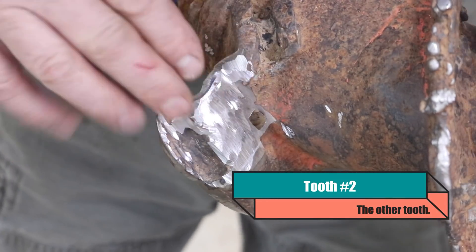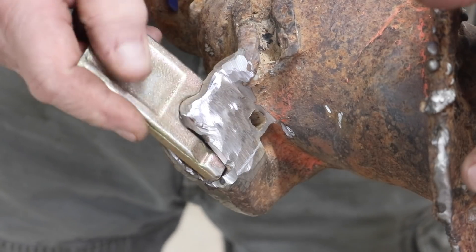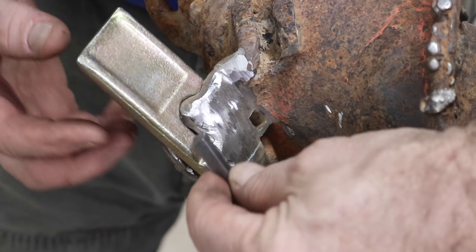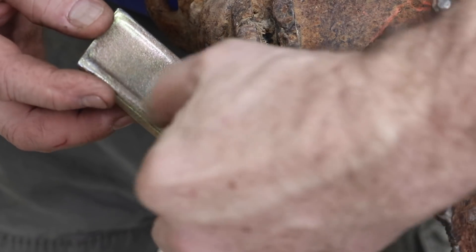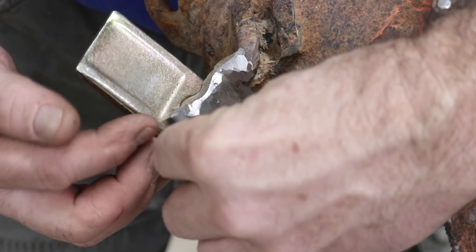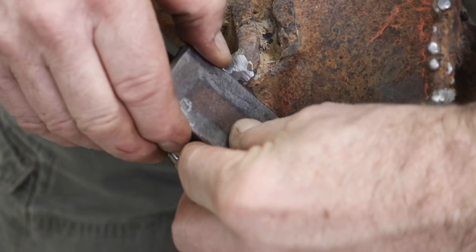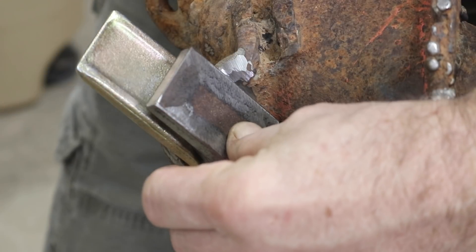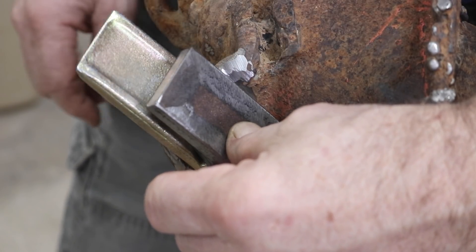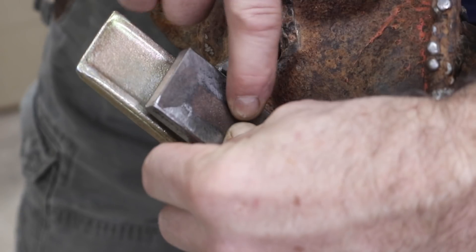I've got this all ground up, dirt knocked out, all that stuff. So this is pretty bad in here — the tooth is going to go in there and this part is all missing, it was just nothing. I'm going to take a piece of quarter-inch key stock and lay it in here and weld it in place. It's more of a filler kind of thing. So this will lay on top, just like on the other side, and we'll just kind of angle it in there like that. Then we'll heat this and bend it down to make contact with the bar. That should be pretty good — it will give us a lot of meat in the pocket here.